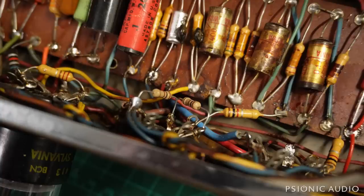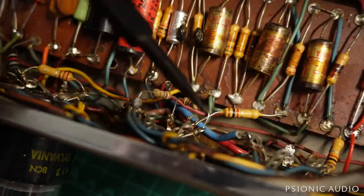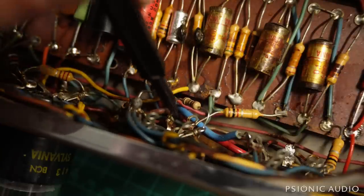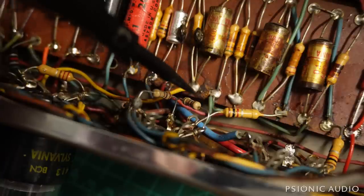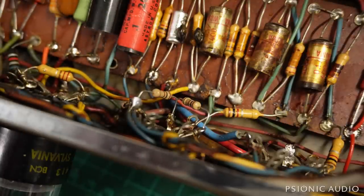Earlier I mentioned that this amp did not have a heater center tap connected. So I created a good artificial heater center tap from each side of the heaters to the cathode of the output tubes — that'll be 10 to 20 volts there, and that'll give me a free little DC lift. It should sound just fine. They're mounted off and above things, so if they were to burn down the line, they're not going to burn the things next to them.